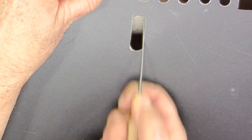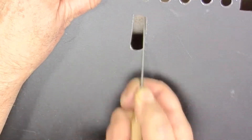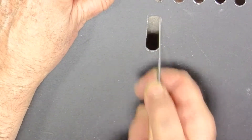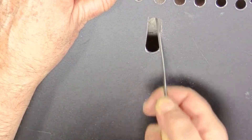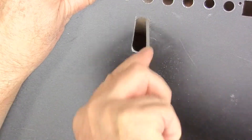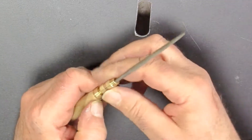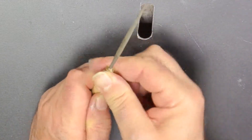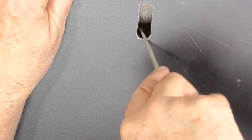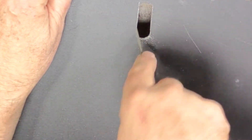I'm going to get these flat sides with the 6-inch flat file. This file is kind of flexible, so it is going to give. Now I'm going to switch to the rounded file — this is called a crochet file. It's kind of like the shape of a lens that narrows to a point, and it's good for rounding out curved sections.